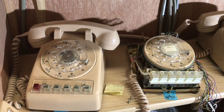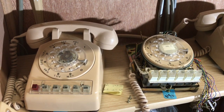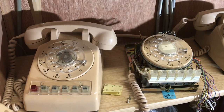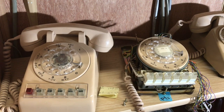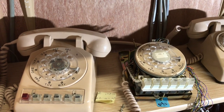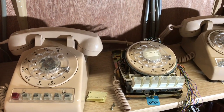I have several Northern Electric six-button sets wired up to the Northern Electric KSU. The Northern Electric KSU could be a 14-line unit. However, with the intercom cards and some other special service cards added to it, I have made two groups of telephones with four lines for each group, so I will have eight phones connected to that system. Most of the phones are all rotary dial.